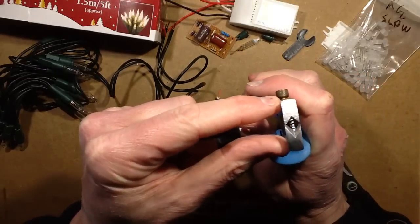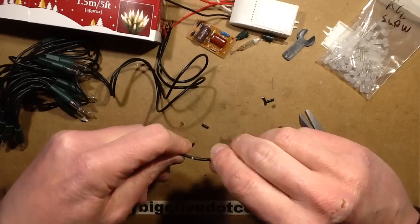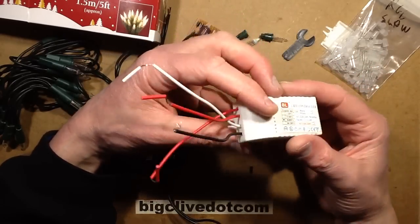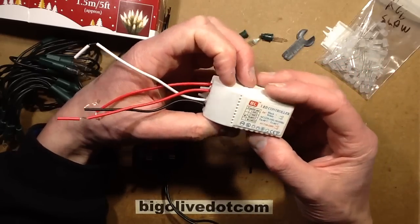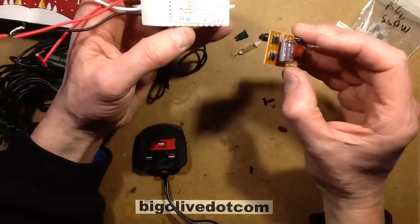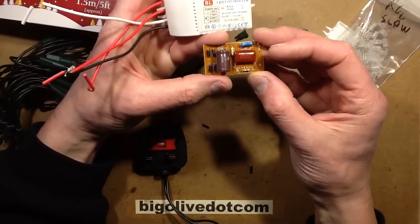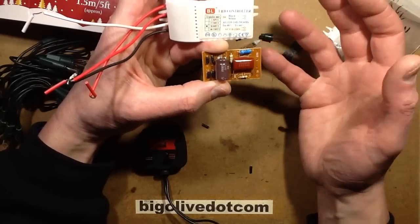This wire stripper, incidentally — because someone will ask — is a Unior stripper. It's a generic, very common type. It's not the automatic type; you set it to the range you work and it's very simple. When you close it down it's got two metal V's that close and pinch the insulation of the cable. You can buy the capacitive droppers on eBay — I'll try to put a search link in the description below. They sell them in bulk, only about a pound each or maybe a dollar fifty if you buy them in packs of ten. Inside it says LED controller, which almost makes you think it's low-voltage output, but it's not — it's a capacitive dropper. You get them for different ratings: 1 to 36, 37 to 50, and the most common is 50 to 80 pieces of LEDs. The only real difference between them is the value of the capacitor.